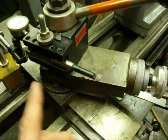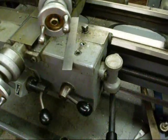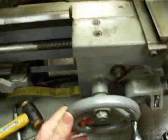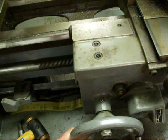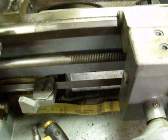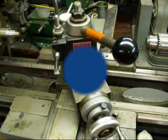Similarly, if we checked it on the compound we would have at least that much or maybe more — and this is still a lathe that's in pretty good shape. One other thing: when you're threading, I'm going to engage the half-nut lever. It's engaged, but look at how much I'm able to move the carriage back and forth. There is that much play between the half nut and the lead screw. That's not really backlash, but it is play. This just goes to show you that whenever you're feeding, you always need to feed in one direction only on the lathe — not back and forth.